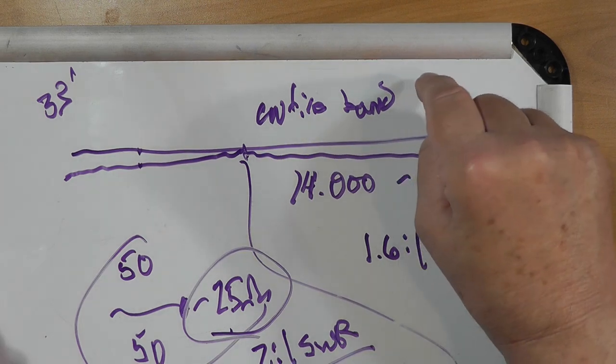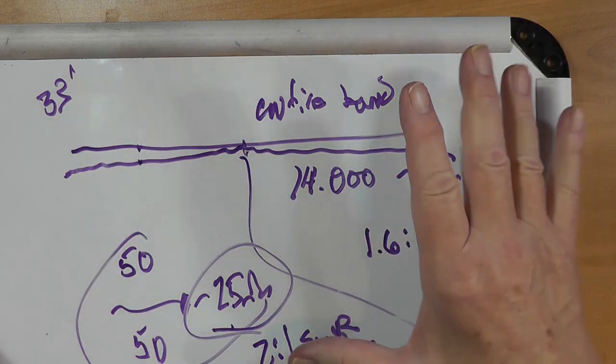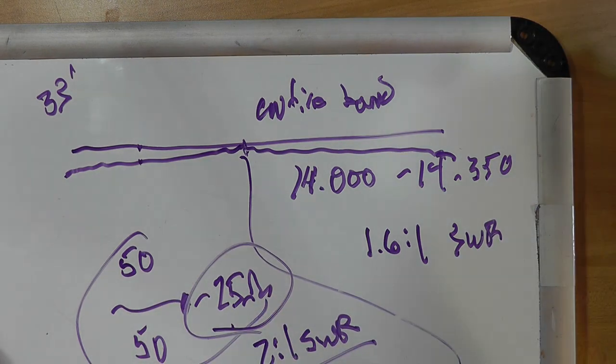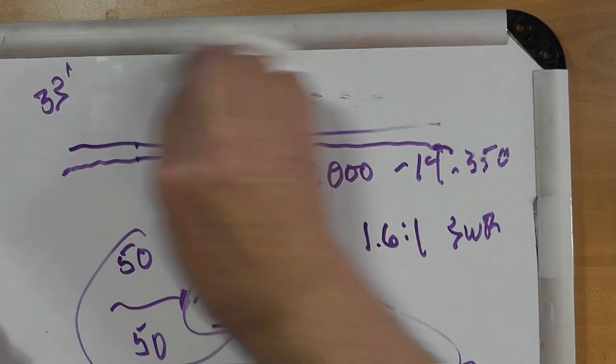So for bands 40 and up through 10 and 6, a single dipole will cover the entire band — so you don't need to do a fan dipole for it. And if you do do a fan dipole for it, you're going to find that your SWR is rather high. Rick finishes with the statement: the intent is to achieve optimum SWR, or am I overkilling this? Yeah, you're overkilling it, because just a single wire will cover all of 20 meters just fine. Most people cut it for the center of the band. You can tweak it a little bit — the SWR will be lowest where you tune it and then slightly go up at the edges. But the antenna tuner in your radio will probably cover that just fine.